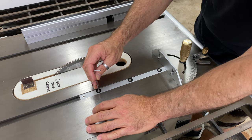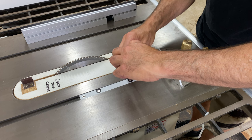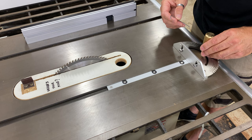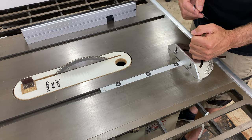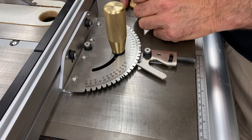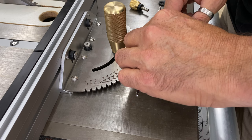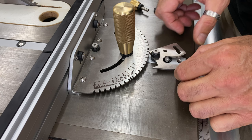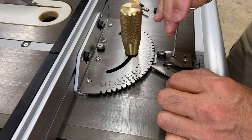The first task was to adjust the expansion rings on the runner to get a snug fit in the mitre slot. The expansion rings are a great feature — easy to adjust — and this model has four of them which ensures a good fit. However, the instruction manual refers to four expansion rings but I could only see three, and the fourth one's location isn't mentioned so I had to work that out for myself. The fourth expansion ring wasn't installed and goes under the locking lever, but when I tried to remove it I couldn't undo that screw at all — it was bending the allen key and I didn't want to strip or break anything so I had to work around it.